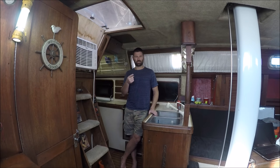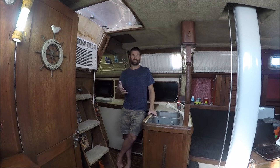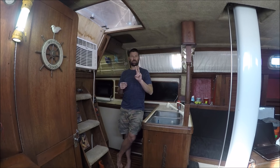I'm trying to think of questions that you might have so that I can just get them over with now. You see, the first two lights I put in are regular can lights for new construction, and I drop them in the hole from above. And I like to do that, one, because they're a little less expensive, and two, they're easier to install. They've got the arms that nail into the trusses.